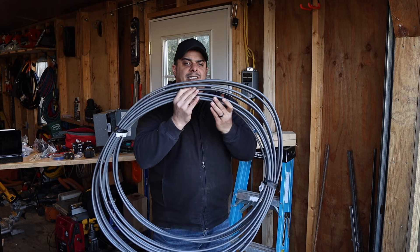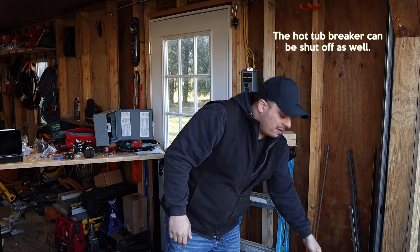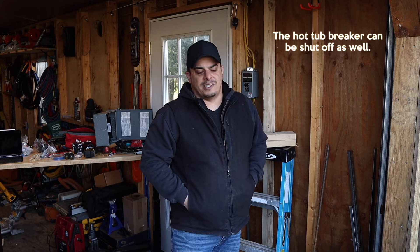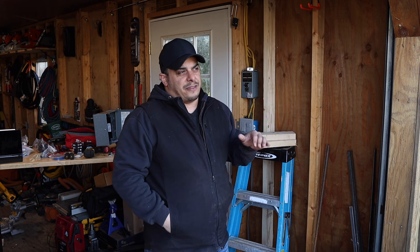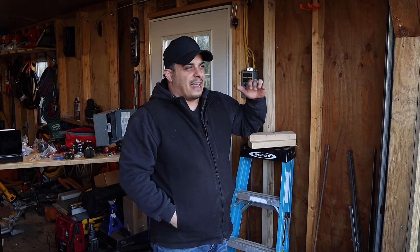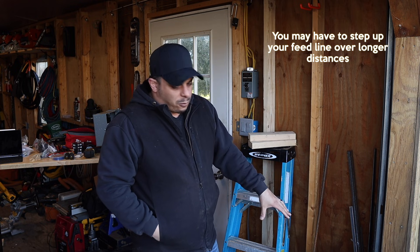For today's video we'll be using 6-3 wire running from my hot tub service — I have a 50-amp breaker inside and I'm going to take the wire off the hot tub since we don't use it very much anymore. We'll start in the shed and work back to the house, which is about 60-some feet away. You need to consider voltage drop — they want you under 5%, roughly 3% at 110 volts and about 2% at 220 volts. We've got our 6-3 wire here.